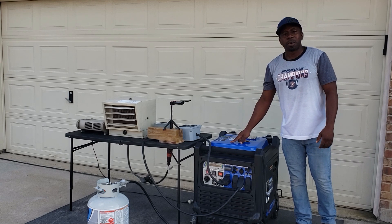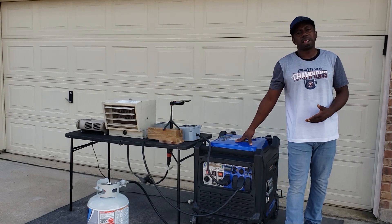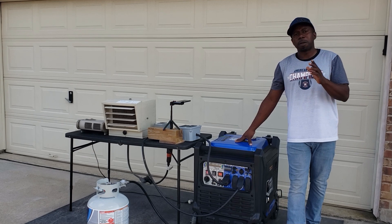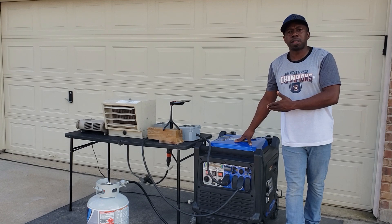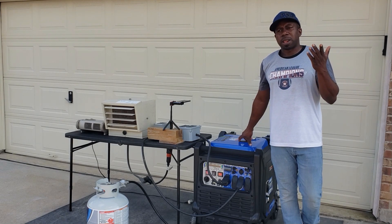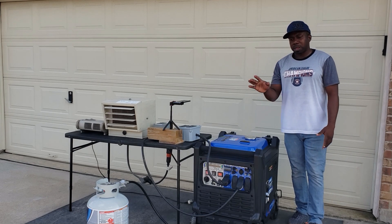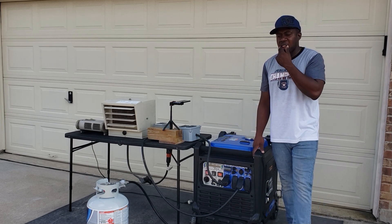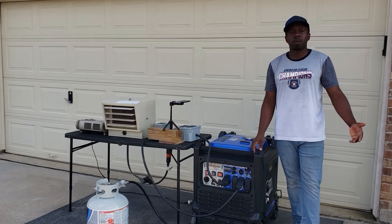We're going to do the 9500 next — the same test on the 9500 and see what we get. Thanks for watching this quick load test of the Duramax 9000. I hope you enjoyed it and I hope this helps you so you won't have to go into it blind — you know exactly what you're getting. If you can figure out your wattage you need for your house, you know exactly what your peak wattage will be. I wouldn't run my generator at that much wattage — I like to stay around 50 to 80 percent. But at least you know your output, and that's what this is about. I'm going to get the comments like 'I would never run my generator that high,' but guys, that's why I'm here — I'm here to load test these generators for you so you know what to expect when you buy the generator. 7700 watts on gas or propane. So there you have it — the Duramax 9000, fully load tested, overloaded, like you guys asked.